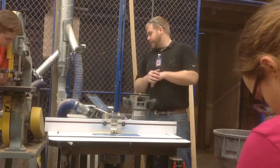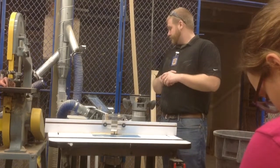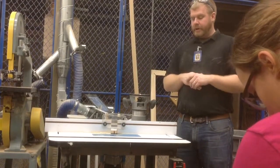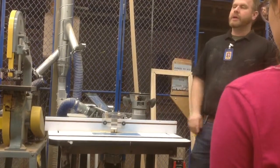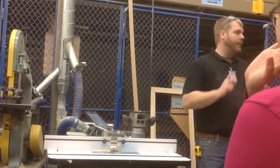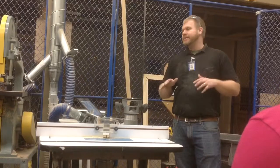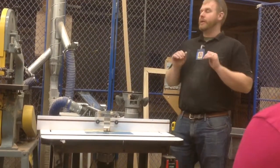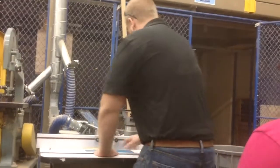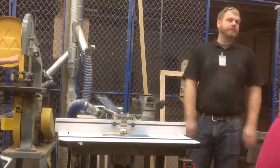Number six: when using the router table, you can only feed the wood on the in-feed side. These router tables have arrows drawn on them and the in-feed side is on the right-hand side. Remember the router table as your favorite band — One Direction. We can only move the wood through the table in one direction. If you think back to that kickback video, when that guy went with the grain or direction of travel, he kind of took the board and it flopped out of his hands. That won't happen if you go from right to left. We go this way — the opposite direction that the router bit is spinning — so we have all the control.